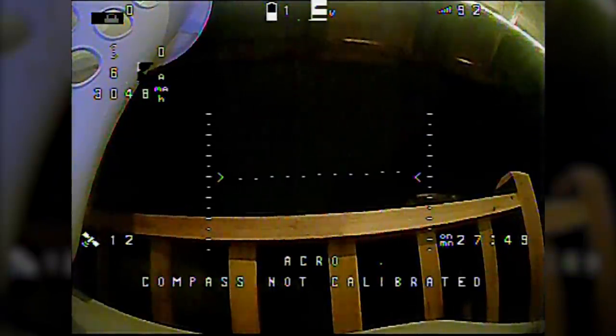Calibrating the accelerometer is really easy. Calibrating the compass is a little trickier — like, why do you even have to calibrate the compass? Don't you know which direction north is? The problem is the compass operates based on magnetic fields, and especially near computers, lights, and metal, all kinds of things affect magnetic fields. Calibrating the accelerometer you'll pretty much do once and it's fine. If you crash hard and shock it you could throw off calibration, but generally it stays calibrated forever. The compass, though, you might have to calibrate every time you go fly.